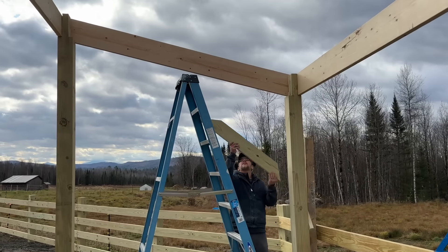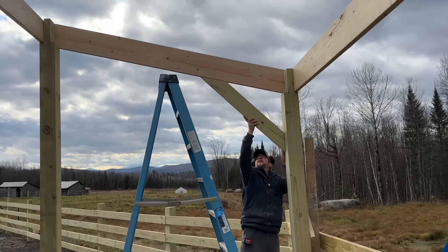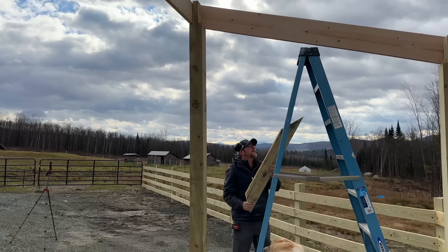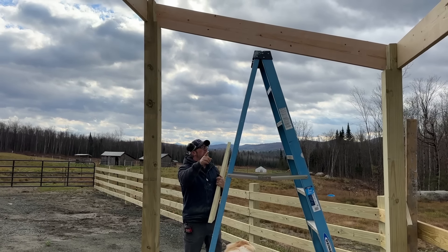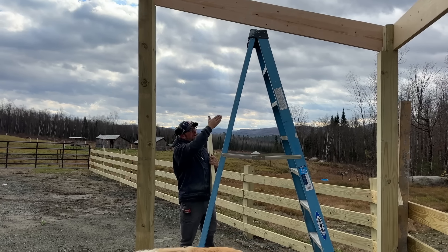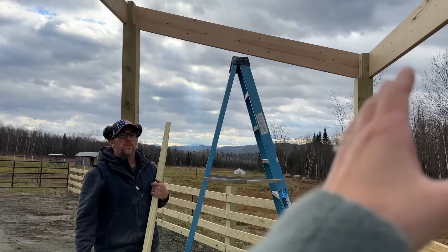All right, I'm going to put this up — tell me how the angles look. Right there, that's good. Definitely not the same angle this way, which is going to be different. So we cut one more of these for the back for that side, then we'll get those two installed. Then we'll check our second template. If that one fits, we can cut one more for the middle, and then the outside edge. We'll have to get a different angle for this side, and for the back it'll be all straight 45s, because this one opens up and that one closes.